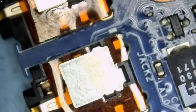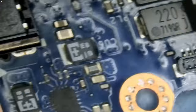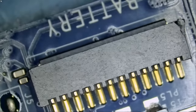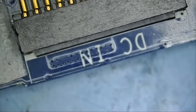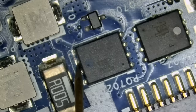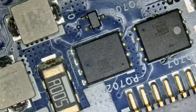Right now we do not have any DC connector on the board because it connects via a cable. It should be labeled as DCN — this one is the battery and this one is DCN. Meter in diode mode. Look at this — a zero ohm short. 0.000 diode reading, voltage drop. We have a short circuit.